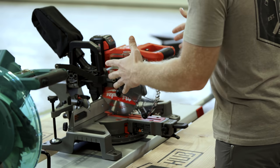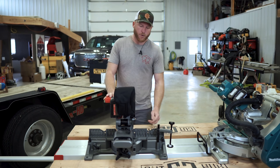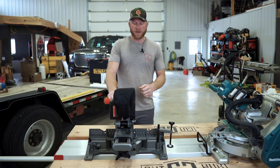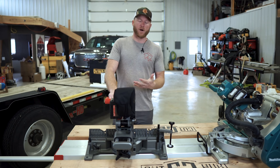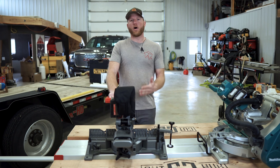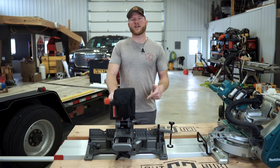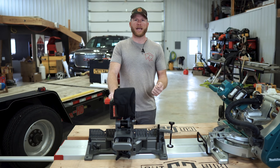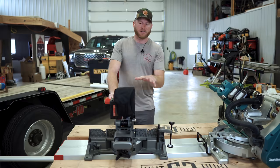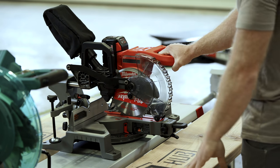Look at the size of it — it's super compact and super lightweight. I think it weighs 20-some pounds, but the first time you see it you think, what is this really going to do? It's super powerful. It's not going to cut your 2x12s or tall crown moldings, but what I like about this saw is that it's very precise for what it is — very stiff, doesn't have a lot of movement when you're using it, and it has tons of runtime. You can literally cut all day with a 12.0 or 9.0 battery. Being a 7.25-inch, it's also super easy to come by 7.25 blades — both rough framing and precision blades — and it's super cheap to put a new blade in. The dust collection is okay; they've got a universal system with a couple of different attachments.